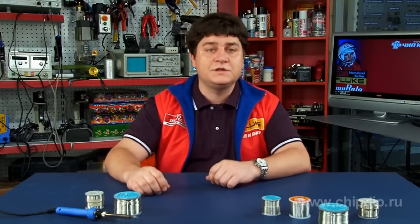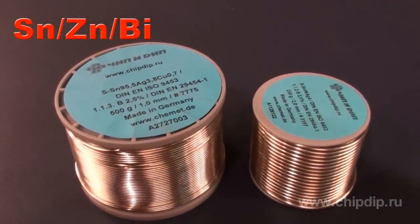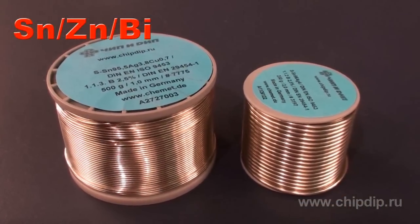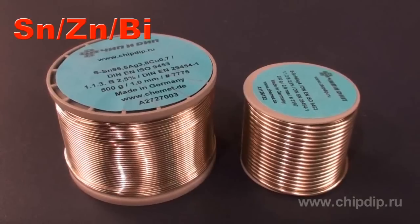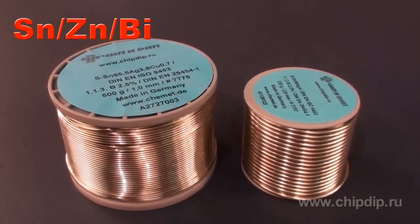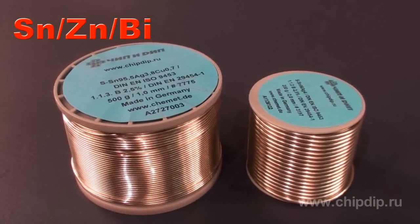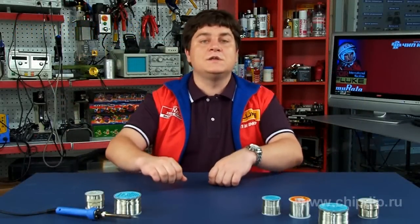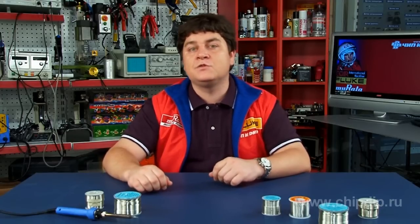The melting temperature, depending on different metal proportions, ranges from 200 to 210 degrees Celsius. Matsushita company confirmed that this solder is the best for soldering among lead-free solders. Copper or germanium makes solder joints more reliable and improves surface wettability. A great tendency to form solder beads in comparison with other lead-free solders can be decreased when adding other compounding materials.